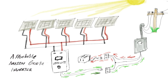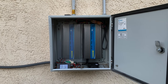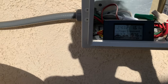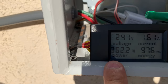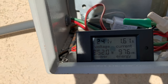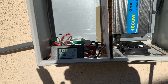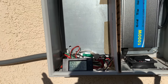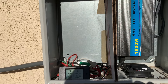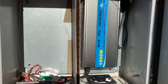That's why I recently changed from 120-volt AC inverters to a single 240-volt AC one. Right now it's putting out 362 watts. Earlier it was doing about 500, and around noon or 1 p.m. it actually does over 1 kilowatt, which is when it runs at peak.